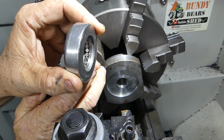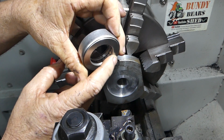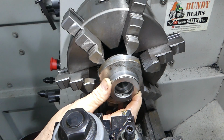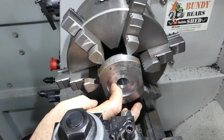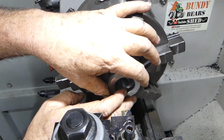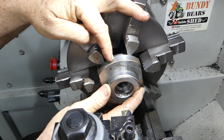See, there's a couple of good thrust surfaces in there, and so when the threaded bar is up it, the thrust on the nuts will be on this hardened steel washer, and the tin shield on the back of the bearing will sit in the plates here and locate. Because that locates there, and I don't want the threaded bar galling on the inside of the plates on the puller discs, this is going to have 2 to 3 millimetres clearance on the threaded bar. So that with this holding the threaded bar central, there's no chance of the threaded rod galling on the puller discs.